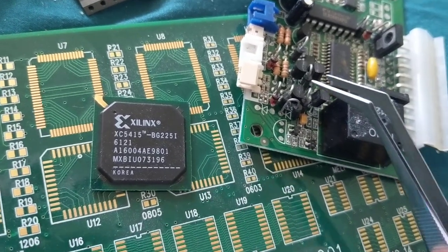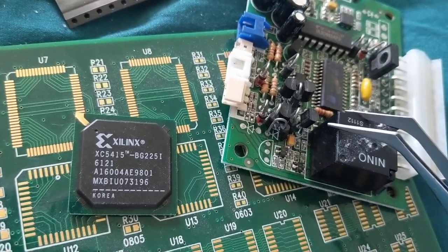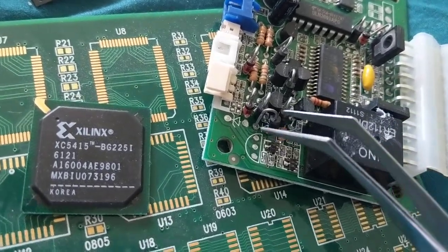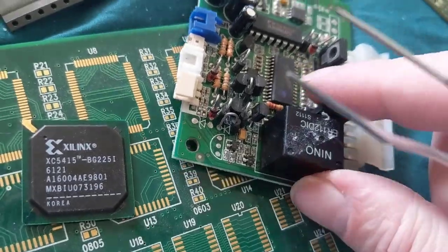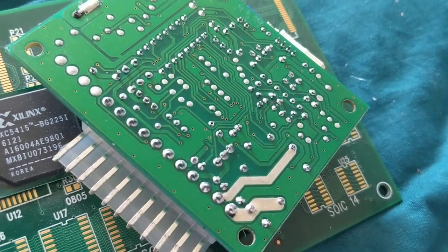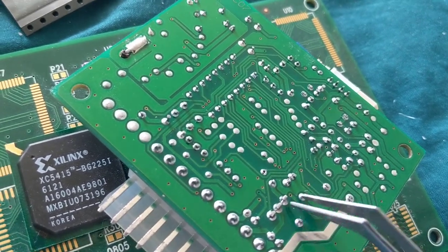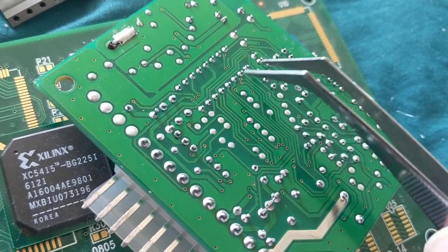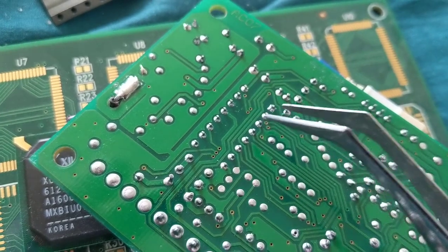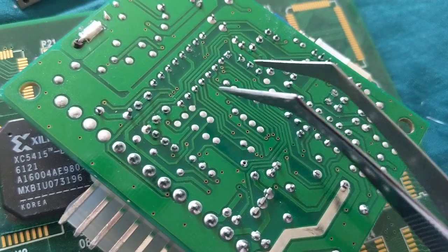So therefore, I just wanted to show you what's going on in these modules in your automotive, what the problems are, and it's not so easy to repair them all the time. It's not so easy as just a cold solder joint on a relay or things like that. It's a relay right here. It's not so easy just to go and say, okay, let me resolder it, reflow it. You have to know how to reflow it. You have to know how to resolder it, like I said yesterday. You cannot make contact with the chips. These are the chips, the other side of it, the through hole, see? These are the leads that were cut. You cannot make contact with this because of static discharge through that chip.